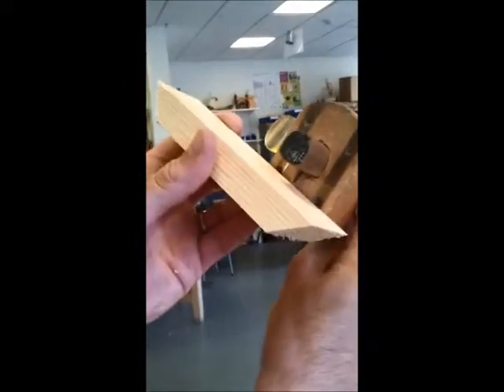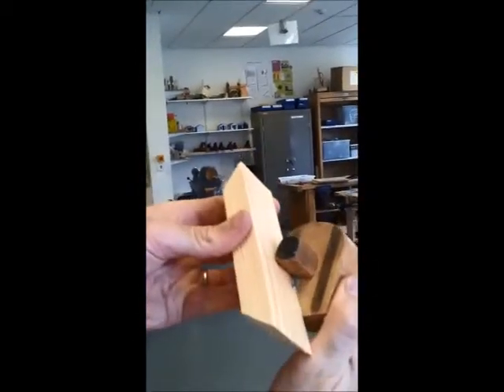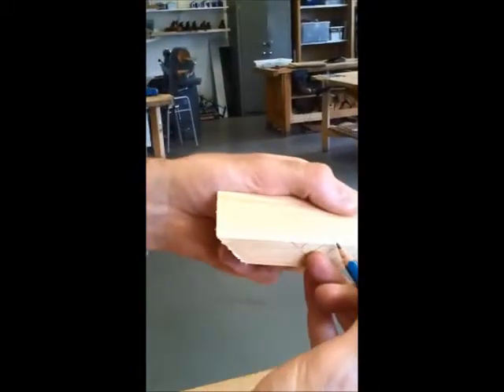Push one against the other, checking the angle. I'm using the stock, pushing up against it. I'm rotating the needle so it's 45 degrees, and then we just very lightly mark down like so, so that you can see. You can then just put your pencil into that mark, and now we know to go back until we hit that line. The alternative could be to just use a steel rule if you want, and just mark 4mm.